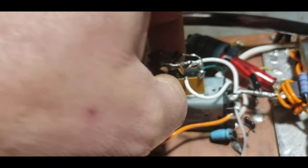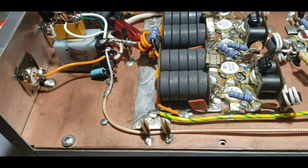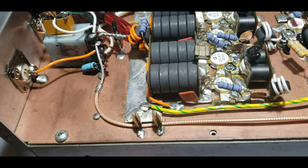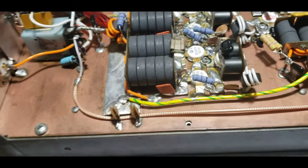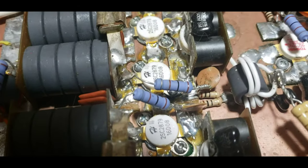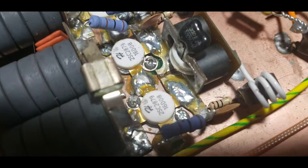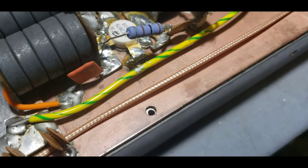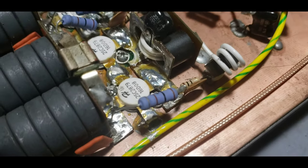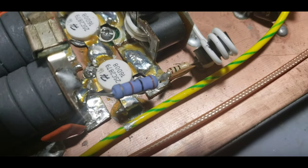This right here is loose — the preamps are loose. This is a two-by-four. I believe you put the HGs in yourself. Got a little heavy on the solder there. I think the main problem is your iron's not hot enough — the way the solder's globbed on there. I can tell you used either some real high-flux solder or a lot of flux to try to get it to spread, which was a good idea. I'm gonna suck some of that solder up and reflow it for you.